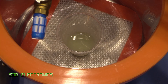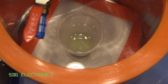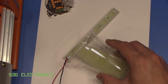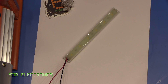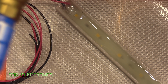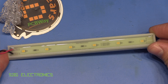It looks like that's stopped bubbling, so we can let the air back into the chamber and take the epoxy out. We'll carefully pour it into the mould with the PCB, and then once again put it in the chamber and start drawing a vacuum. That poured really nicely into the mould and as you can see we've got a really nice bubble-free finish — looking pretty good overall.